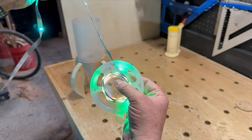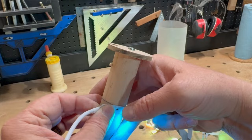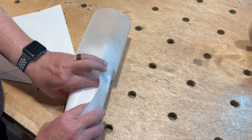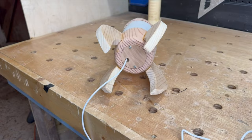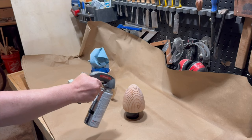With the body of the lamp complete, I moved on to the lighting. I used an LED kit that I had — I'll leave a link in the description below. I started by feeding it through the cap and then through the hole in the post, then wrapped it around the post, testing to make sure the post still slid into the lamp okay. Once the lighting was installed, I could see that the individual LEDs were really visible, so I lined the inside of the cylinder with some label paper and that ended up working really great. After some puttying and a little bit more sanding, I applied a couple coats of spray-on satin lacquer to the base and the top.